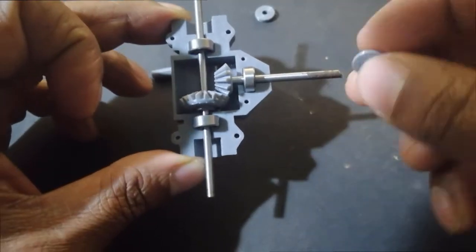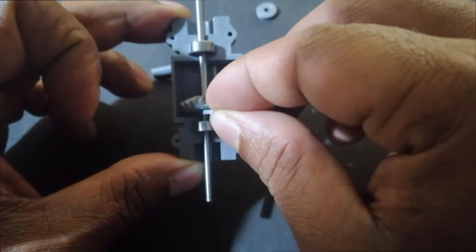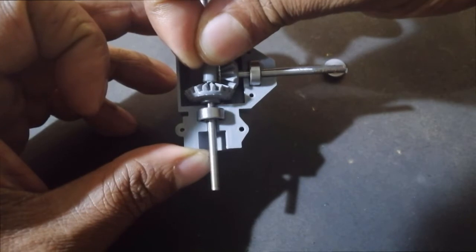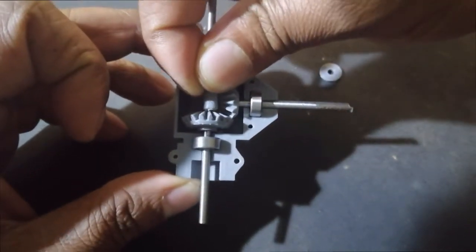The other circular washer is going to be placed at the back side of the wheel shaft gear in order to increase the area of contact between both the gears. The cylindrical washer is going to be encased on the front side of the wheel shaft to lock the position of the wheel shaft gear.